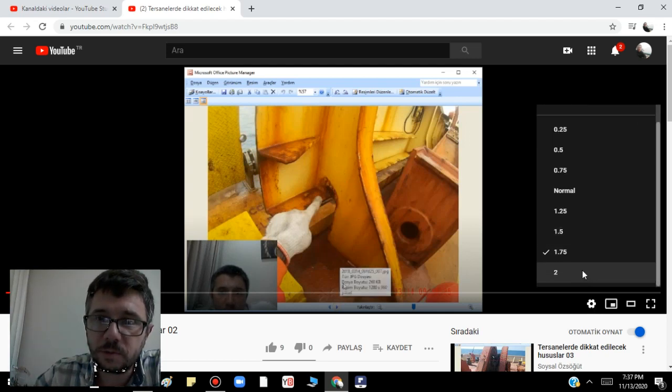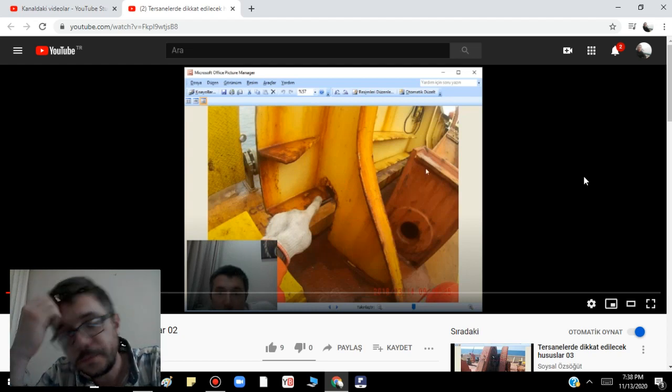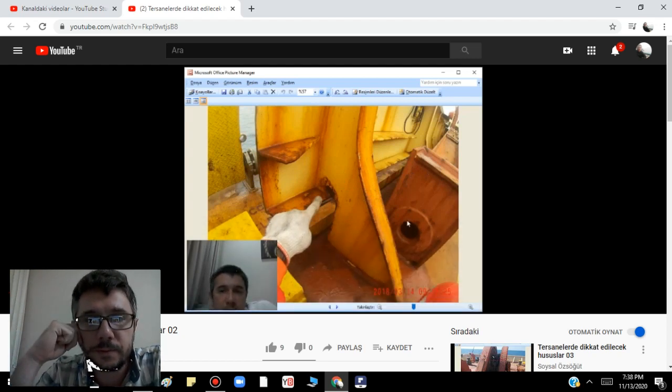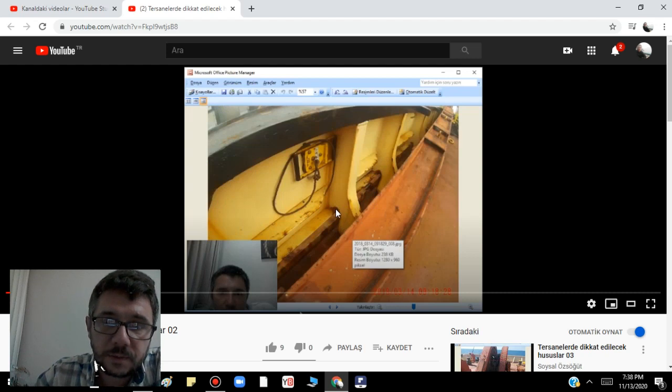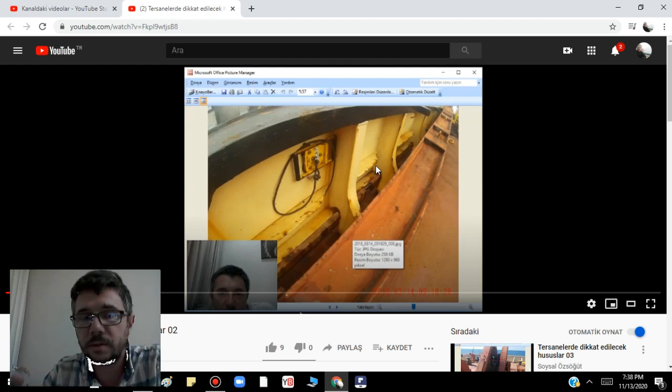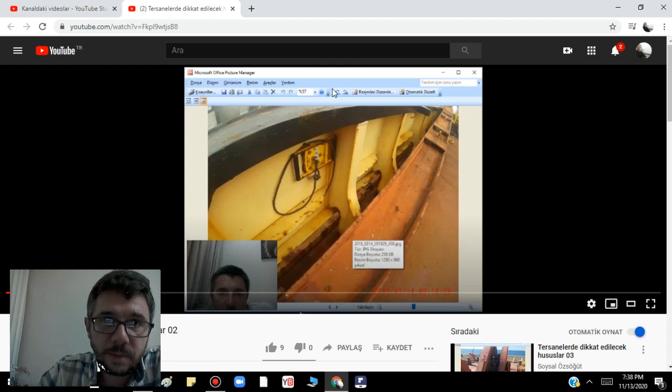You see these frames on the main deck in this part. The back side of these collapsible extensions — this is the frame, the down part. The collapsible extensions go like this, rising here. So it is very difficult to check this back side, also here on the main deck. You have to check the condition of these frame connections with the longitudinals — that is also an important point. The underside connection part here, especially this part — if this is just a little away from the side of the vessel, because this is the pilot walking way.